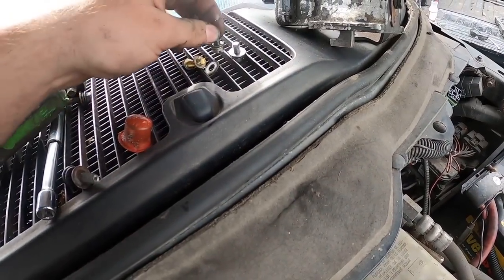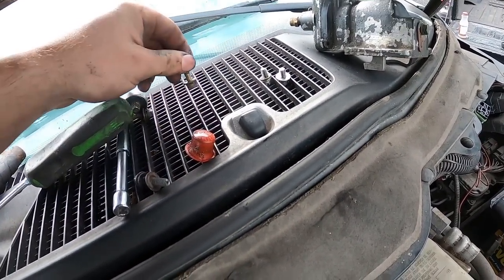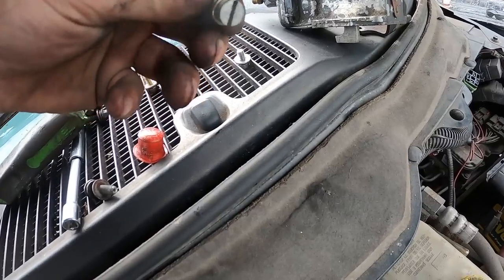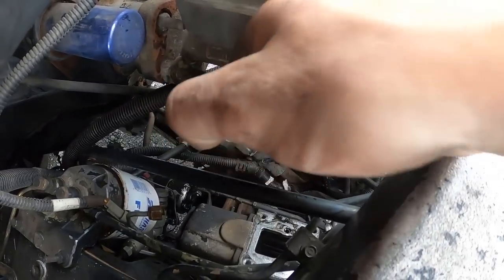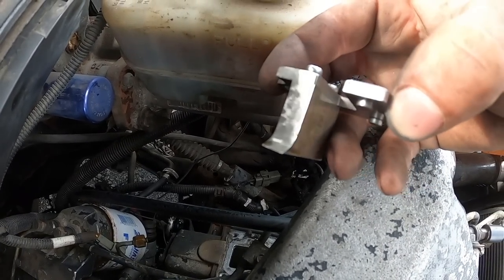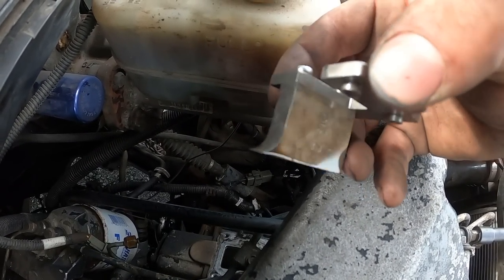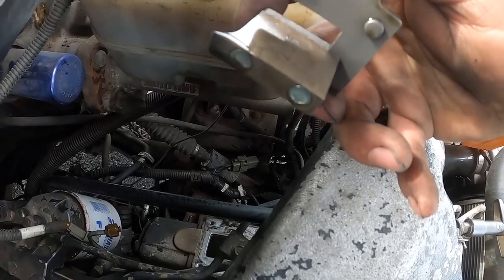Here are the screws that come out of the AFC, and these are the screws that hold the fuel plate in. Make sure that you do not drop them as you're pulling them out. Look at that — that is not a stock plate. Actually, it is a stock plate, but somebody ground it down to be a 100 plate. Basically it's all flat.